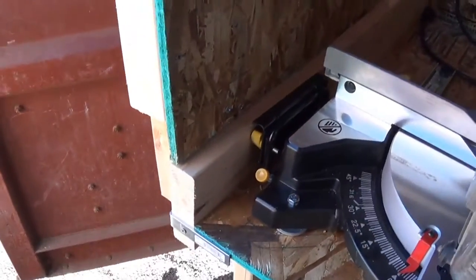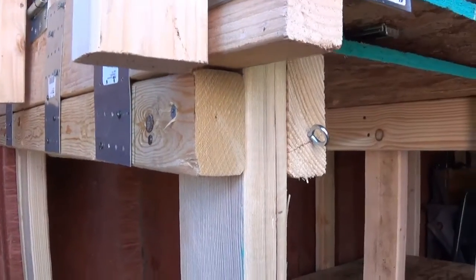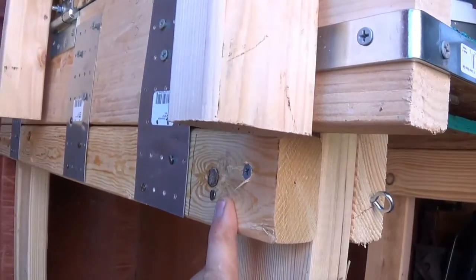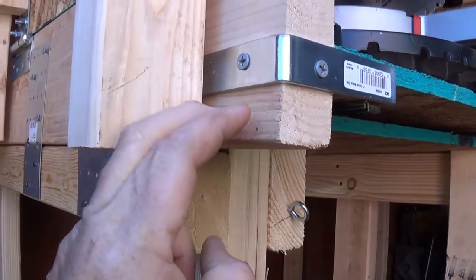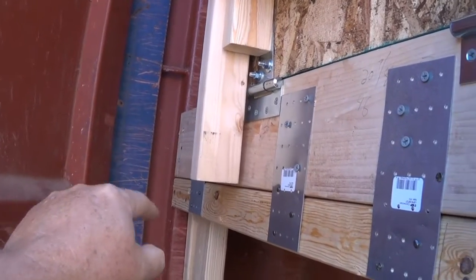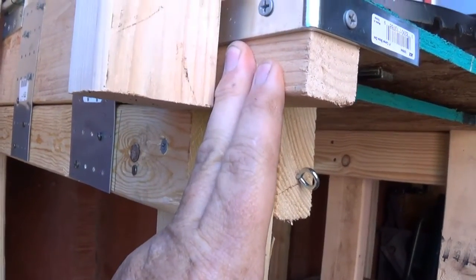So on the side here, I had to bring it up to this height. What I did on the table saw was I got my 2x4 legs out here. I took a 2x3 just to give me something to rest on, because this 2x6 had nothing to attach to other than that back leg back there. So there was no way for me to support this. By putting the 2x3 here, it gives it something to rest on.